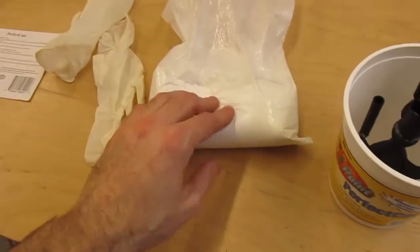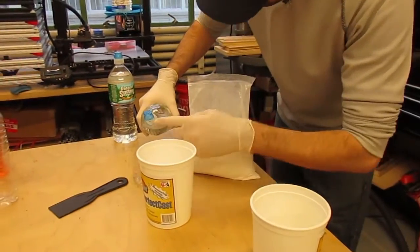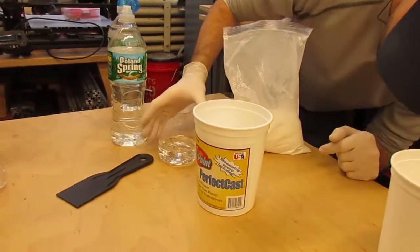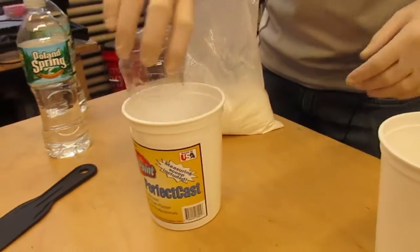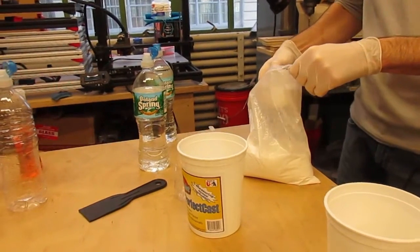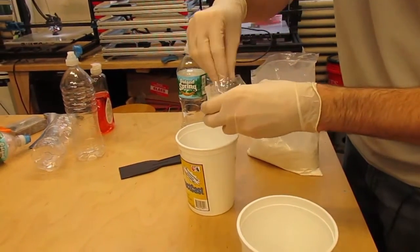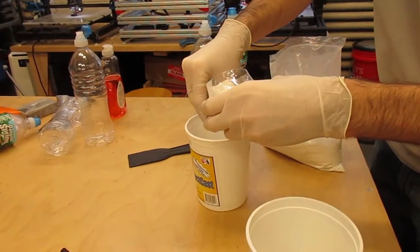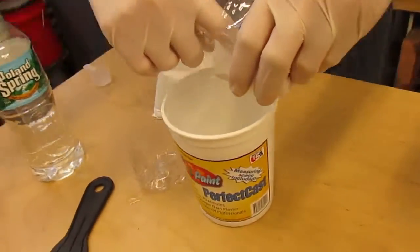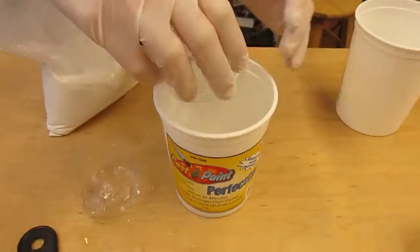As far as using the plaster, it seemed to be the same as plaster of Paris — you mix water and powder using gloves, and there's a special ratio, I think it was three to one. I've never really used plaster much so I wasn't sure how to mix it, but you're supposed to put the water in first and then slowly sift in the powder. I was pouring it a little too slowly so by the end it was starting to set. We actually used more than we thought we would because the powder dissolves pretty rapidly as you mix it in.